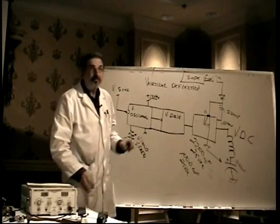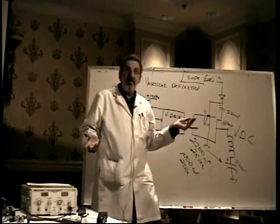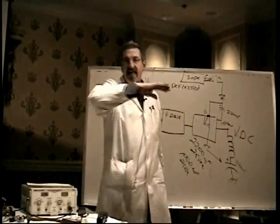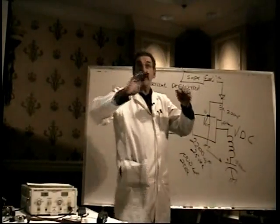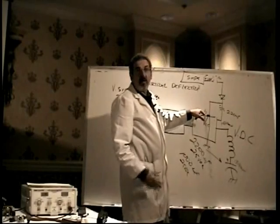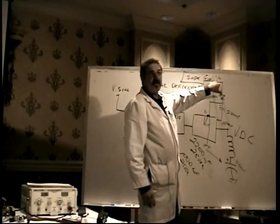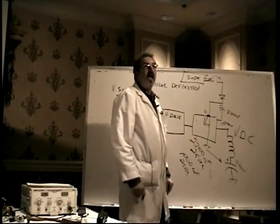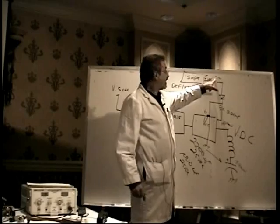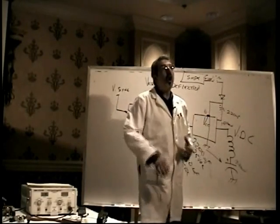So, here's what you do. To prevent you from burning out the new resistor you just put in there, you do one of two things. You get to the monitor. I'm just going to repeat the whole process. Flat screen. Okay, no vertical deflection, not horizontal, not high voltage, not any of that stuff. Measure the voltage with the power on at this pin, the power pin. It's not there. Yippee. Measure the resistor. It's open. You replace the resistor, and when you go to fire it up again, put your finger on the resistor and then turn it on. And if it gets real hot real fast, woo, turn it off real fast before the resistor opens up.